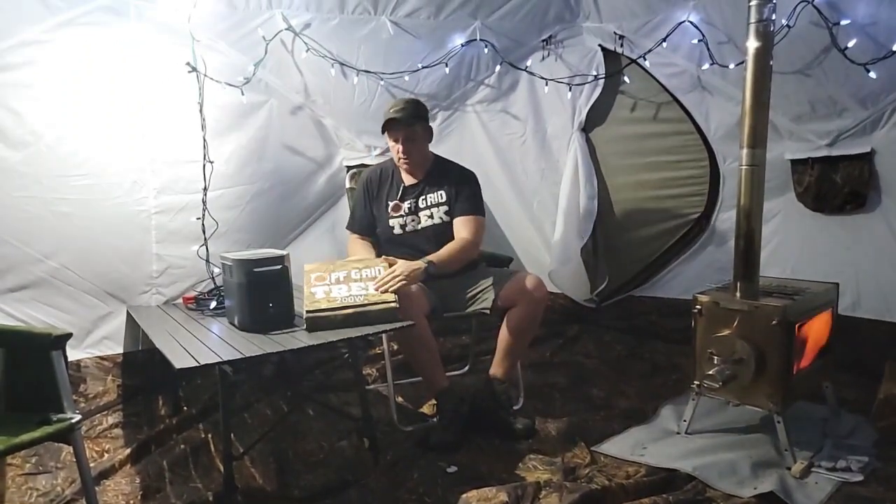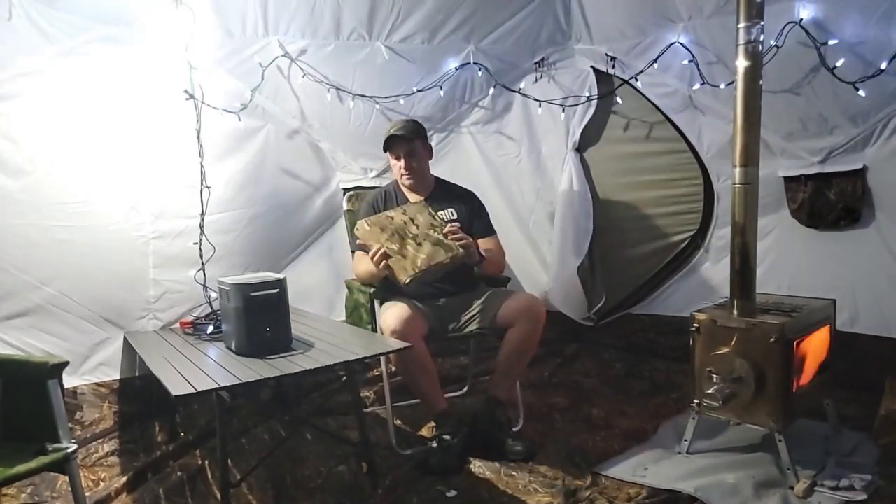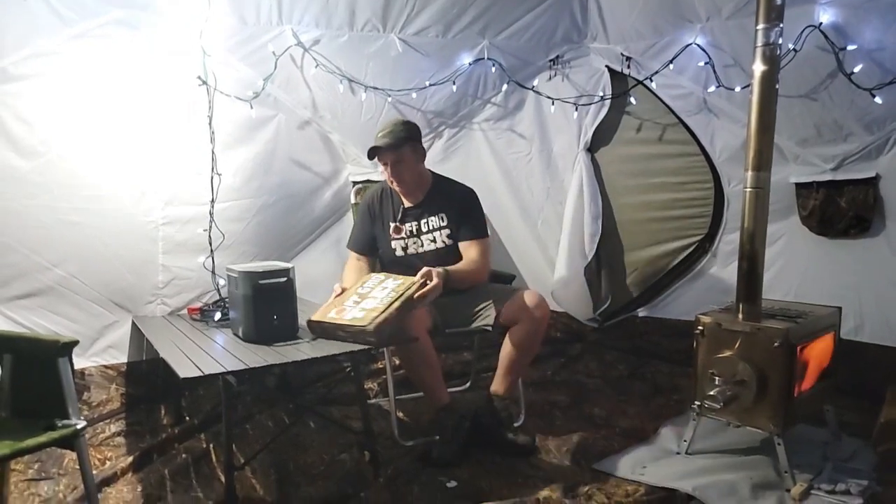Some of the products we're going to be offering with it — and I'll have this on our website soon — include our 200-watt solar blanket. A lot of you are familiar with it: 13.6 pounds, very lightweight, folds up to the size of a laptop. We'll be offering the EcoFlow Delta Mini with our 200-watt solar blanket, even two of our 200-watt solar blankets, and also our 120-watt. Charging from one 200-watt solar blanket is going to be four to five hours, and two 200-watt solar blankets cuts that in half — it's very quick.